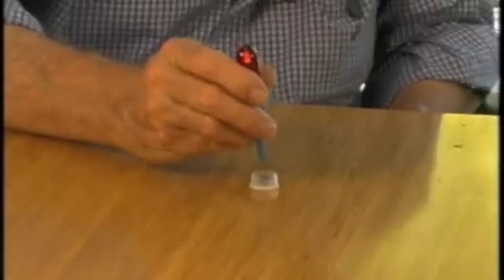How can I make sure the MagProbe is working before I troubleshoot? The main problem technicians have: if the light doesn't turn on, how do you know the device itself works? You use the little magnet that comes with each unit — it's in the tip of the tube — and you can self-test it quickly, then go back and test the relay. Now you know it works, because anything can suddenly fail — a battery or physical damage. These last for 5,000 five-second tests, which translates to roughly three to five years. We self-test every unit at least five times during manufacturing to ensure no defects.